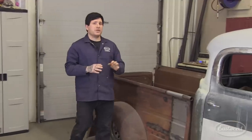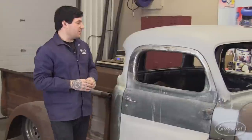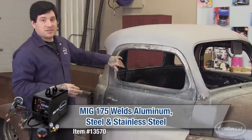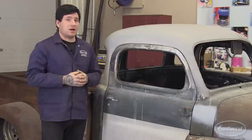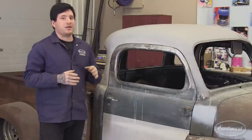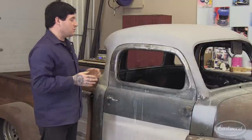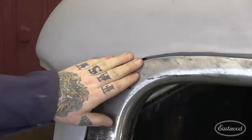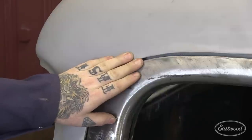For the front side of the door I used the TIG200DC, and I went ahead and used the MIG175 to weld up the back part of the seams. Now that everything was welded, I could grind everything and blend the seams in with an angle grinder and a flat disc. Now that the door is pretty much structurally complete, I can go ahead and just fine-tune any of these gaps here that are uneven from cutting off the drip rails.